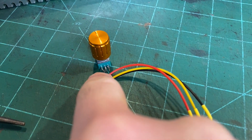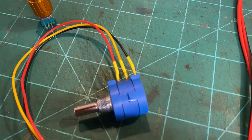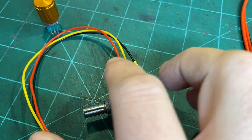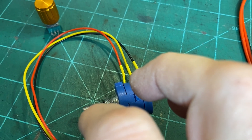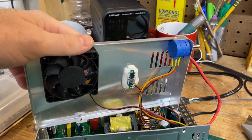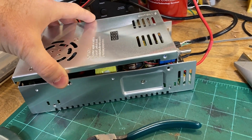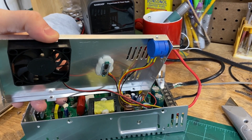Just for clarification: the original wiring color order was red, black, yellow. In the new configuration, with the common pin being the back one, the order is black, yellow, red. It doesn't really matter which way red or yellow go — turning the knob one way will raise the voltage and the other way will lower it. The 10-turn pot from Amazon fits in there perfectly, doesn't interfere with anything, and we can get it all put together.